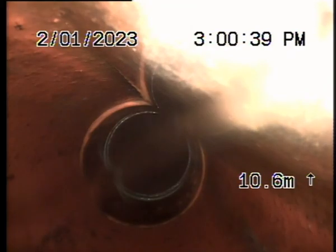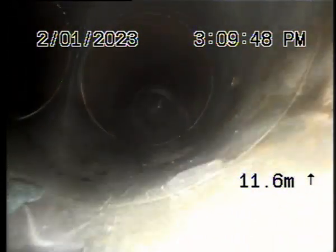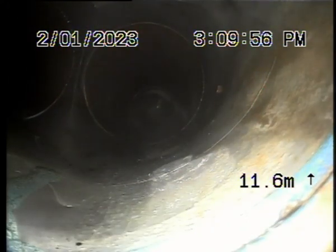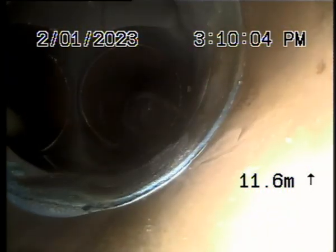Send the jetter up through there and see what happens. So it appears we're up the right branch — there's PVC there. If you look around as we go up, on the left-hand side is a junction. I can't — trust me, there's a hose there going up there. I'm pulling on it — that's it there. Hose goes straight up that junction. Cutting some roots out — we'll have a look from downstream.